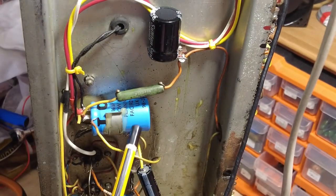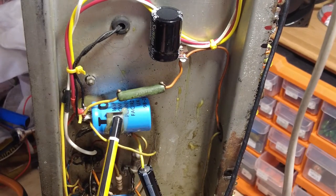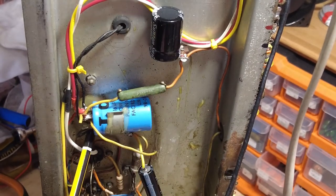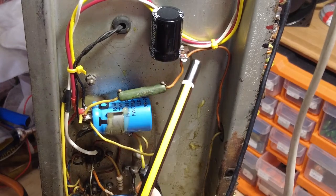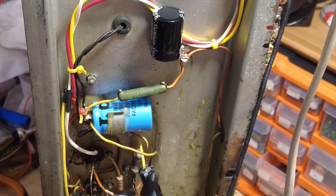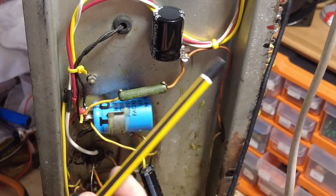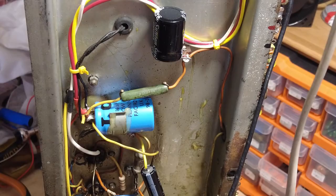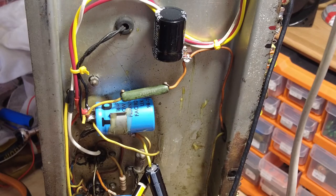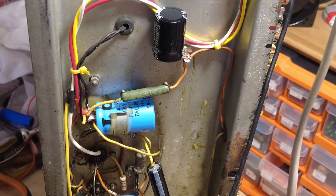What it looks like is that bracket was pinched for that cap, then they put a tag strip on there. That wire just fell right off — that's feeding the screens. This one is 100 microfarad but it should be 220 microfarad at 100 volts. This master here has a 470 microfarad instead of 250, so it's being changed. It's flopping about in the breeze anyway.